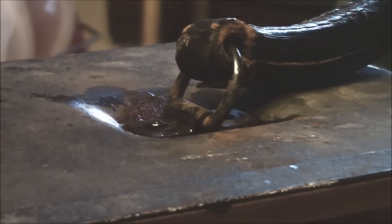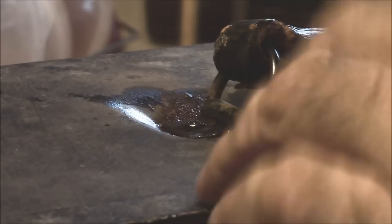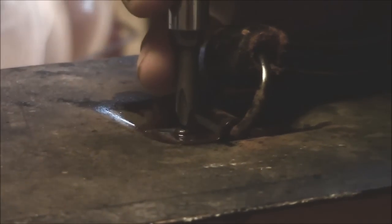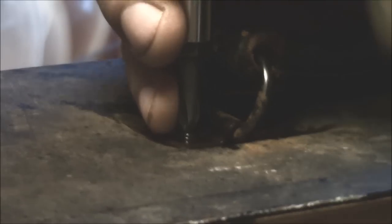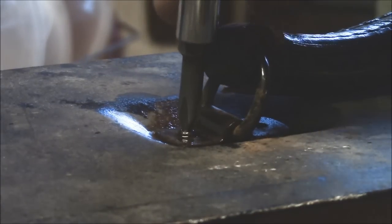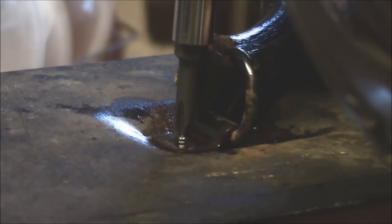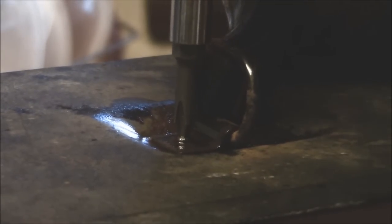Well, a little time has passed here. I'm going to go ahead and see if I can dig any more of that out. What I'm going to do now is fit that screwdriver in there and kind of tap on it to see if just the shock will break it loose a little bit. Also, these go through underneath and I sprayed a little bit of that oil underneath there. Let's see if we can turn it. Sometimes if you try and tighten the fastener, it'll help break it loose. I'm really pushing down on this.